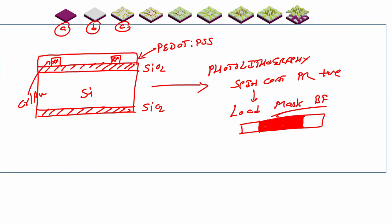So we are using a mask which is a bright field mask, and then after spin coating the photoresist we have to do a soft bake, we already know that, load the mask, then do UV exposure, then you have to do the photoresist developer, and after the photoresist developer you have to do the hard bake, and after the hard bake you have to etch PEDOT:PSS